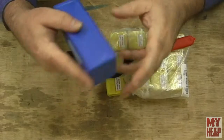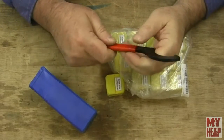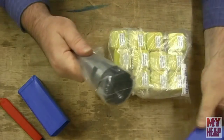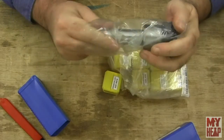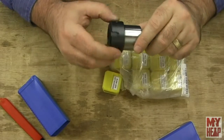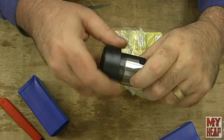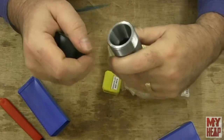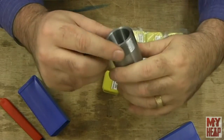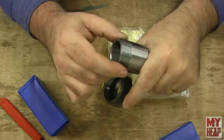Let's start by taking a look. You guys have all seen a collet wrench — nothing special there, but it does have a soft handle, so that's good. The collet chuck is Morse Taper 3, ER32. The nut feels pretty smooth, and when I open it up, it looks like it's ground all around. The collet threads feel pretty smooth, so maybe that's a bonus.